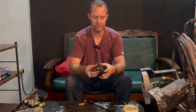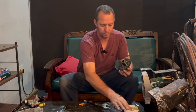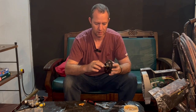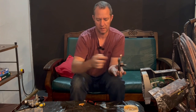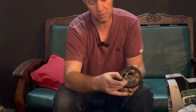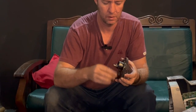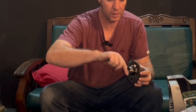And this is the drive gear. The drive gear has got two little metal bushings. So we're just going to put on the axle, put some grease there, and on the back side, there's another axle over there. Okay, there's a thin one and a thick one. The thick one goes onto the side where the counterweight is, just sits there like such. And the thin one goes onto this side. Okay, so then this is where the rod's going to be.